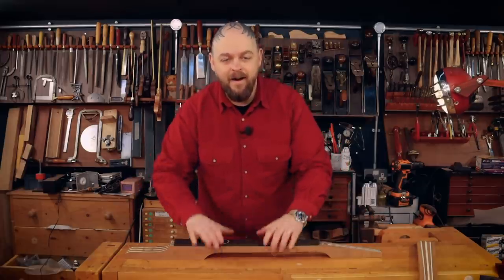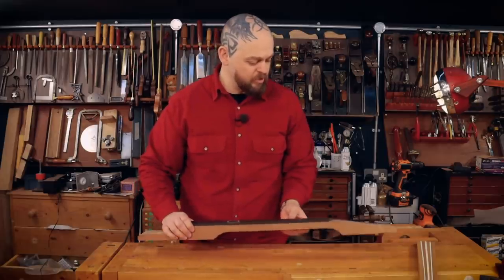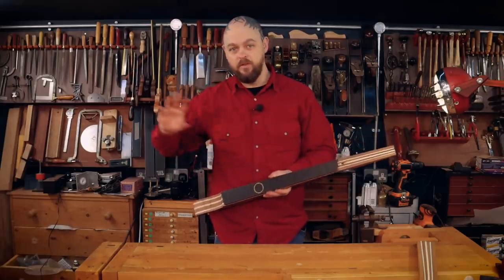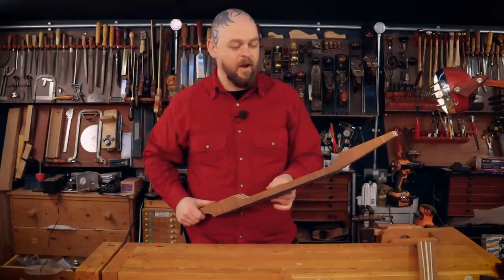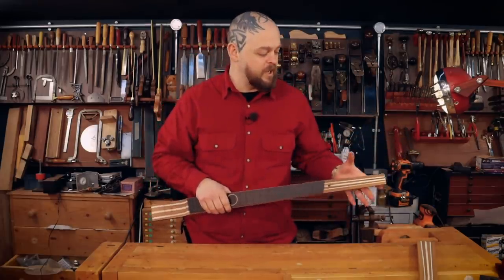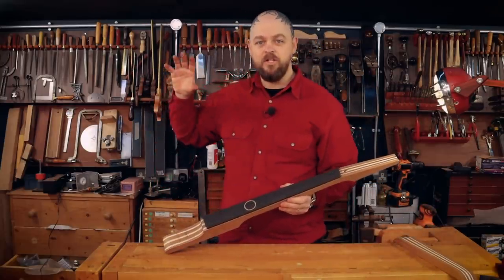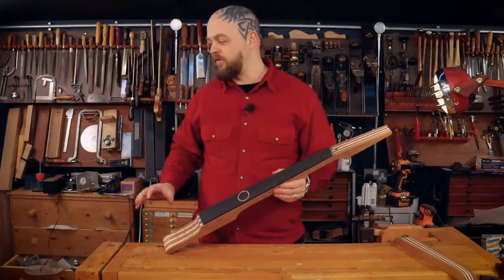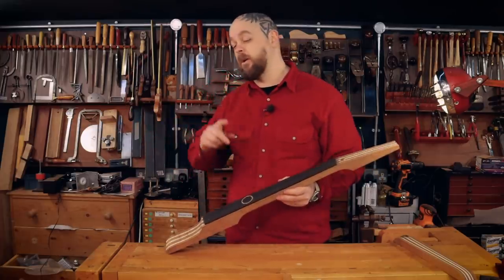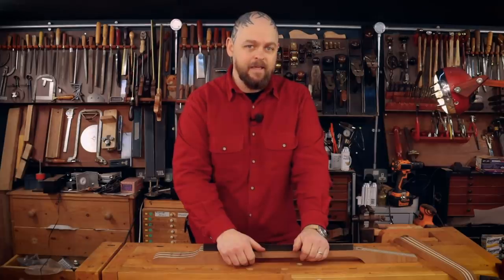What an intro. I am finally, for the first time since January, building a scratch built guitar. Through COVID, I've had to build a new workshop at home rather than at the factory, and I am totally loving it. In this video, I am going to sort out wings for the headstock. I am going to figure out some custom burl maple binding from multiple pieces of offcuts from the top and the back. I'm going to joint the top and the back. I'm probably, come to think of it, going to have to make a shooting board.